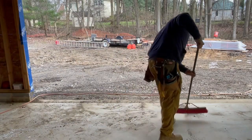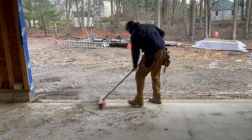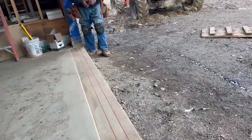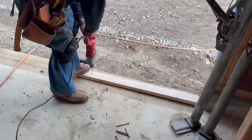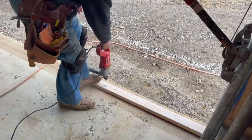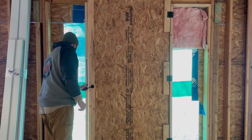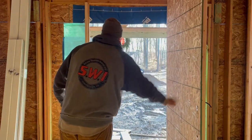We wanted to close off our major openings to retain as much heat as possible going forward. In the near future, we'll need to hold about 45 degrees in the house for drywall — temperatures diving in winter with drywall installed causes it to shrink, meaning nail pops and other issues. We're going to get some insulation and a propane heater, but Smitty and I also installed a temporary front door. If you look closely, those are Raptor paper side lights — we keep it classy around here.